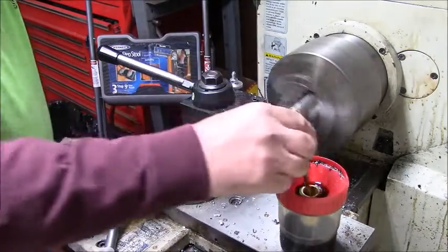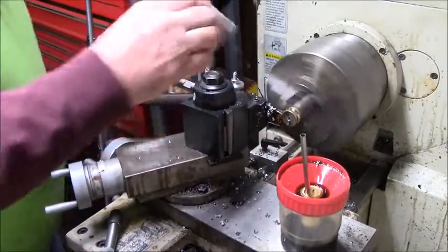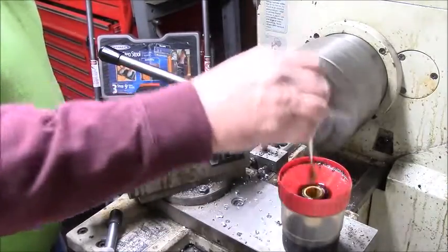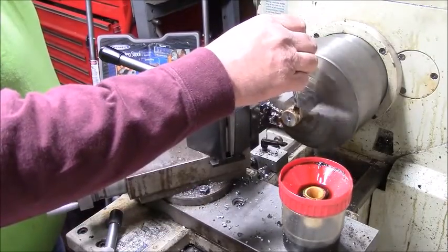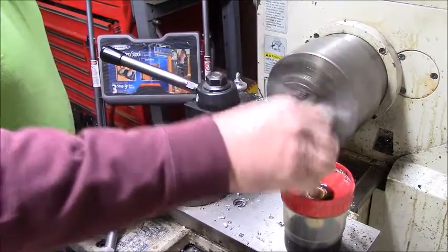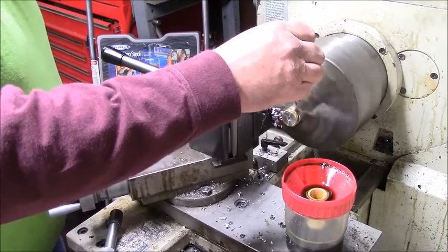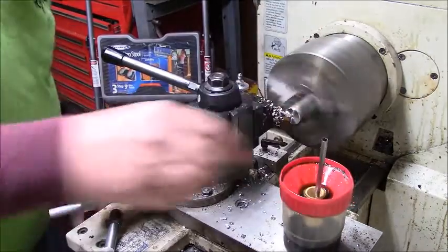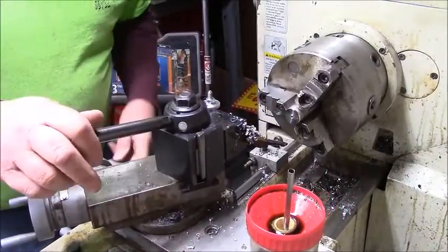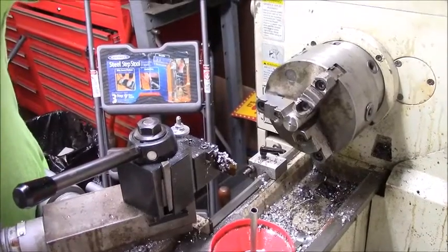And this will be the adjustment knobs for the top of the tool holder. And you've heard me say this several times in my videos, 1/4 20 is plenty strong enough for these blocks. And that's what we use. In fact, this cut-off tool right here is one of mine's 1/4 20 rods. You'll notice my tool holders that I've machined, it's all 1/4 20. So I'm going to finish getting these out of the chip pan, and I'll go ahead and turn it out, and I'll machine some more off camera.